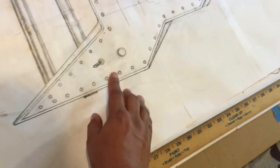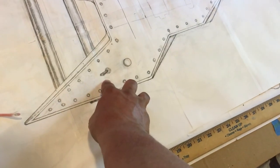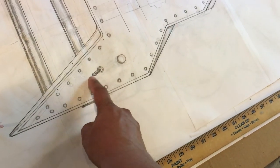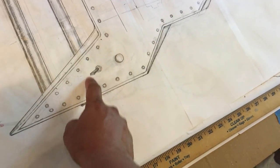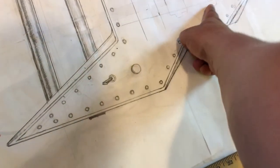With the switch, I'm going to hook it up to the battery so that when it's in the down position, it activates the bridge and the neck pickup, and the LED from the switch is going to come out the tip as a white LED. Then when the switch is flipped up, the LED is going to be off and it's just going to be the single coil.